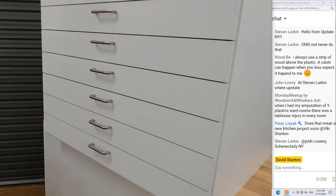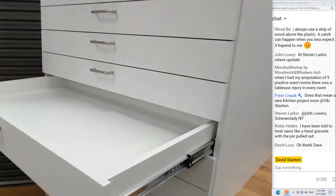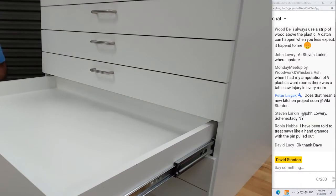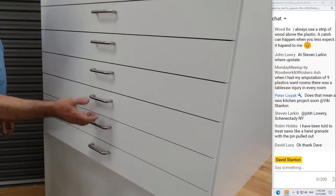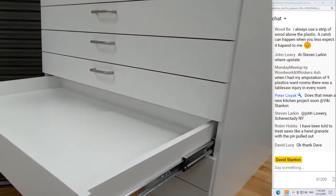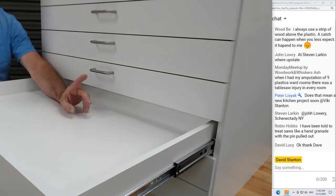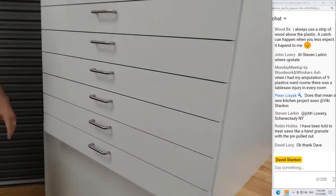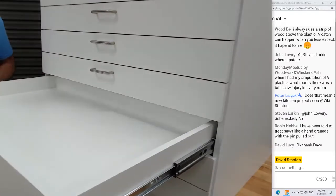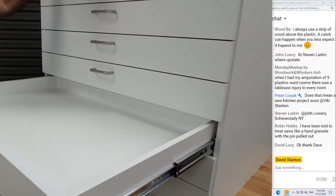All right, so these are the drawers, and you can see now I've got all the handles in them. They've come up really well. They're absolutely beautiful. So there's seven drawers there, and these were just a couple of sheets of melamine only a couple of weeks ago. The only thing I bought apart from the melamine was the handles and the runners and the screws, because remember, this is all pocket hole screw construction, but you can't see anything. Nothing on the sides. Nothing at all. Okay, the inset. Let's see how it looks.